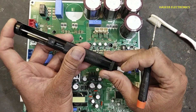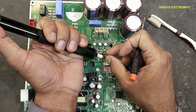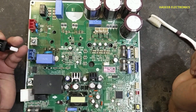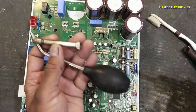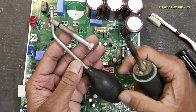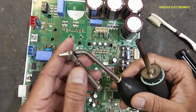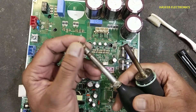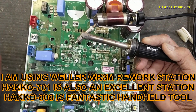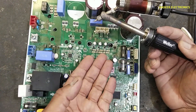The manual vacuum pump is also not entirely safe, because when we are sucking and lifting up, it can drop solder droplets on the board. Similarly, a balloon sucker can be installed on the soldering iron and used as a vacuum sucker. The most safe method is using a proper vacuum-based desoldering tool — it will heat up and suck the solder at the same time.